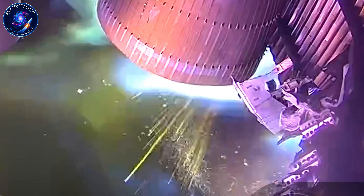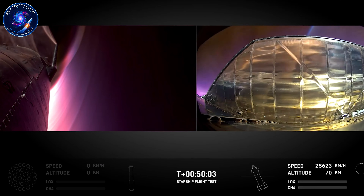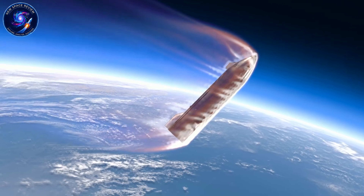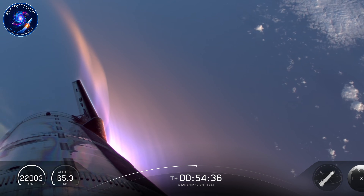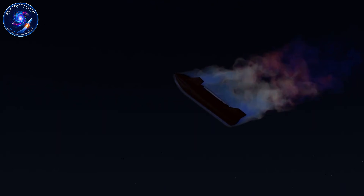The standard solution: add heavy metallic heat shields. Raptor 2 used these shields extensively, wrapping around the engine bay like armor plating. Each heat shield added over a ton of mass per booster. Multiply that by 33 engines, and you're hauling 33 tons of protection equipment that does nothing except defend against heat. Behind those shields, you need fire suppression systems — SpaceX installed over 10 tons of equipment: nitrogen tanks, distribution lines, sensors — just to protect against fires that the enclosed heat shields themselves create conditions for. You add shields to protect components, then need fire suppression to protect against problems the shields create, and suddenly you're carrying 11-plus tons whose only job is protecting other equipment.